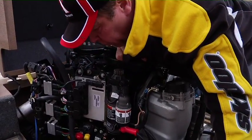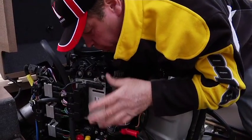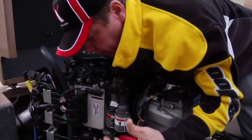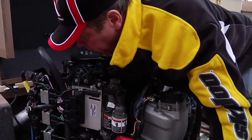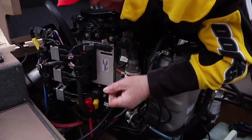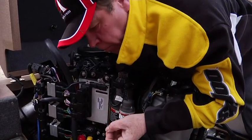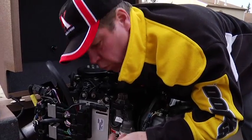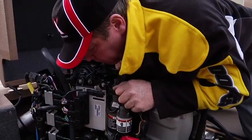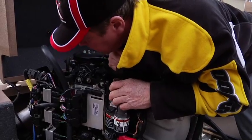There is a really nice Mercury diagnostic system we have in our service department, as most Merc dealers do. If there's an odd issue, a running issue or something, we have a diagnostics that can point us usually right to the area of concern. There are some fuses on the engine for the fuel pump, the starter system, and so forth, and I recommend you carry just some extra, I think 5, 15, and 20 amp fuses, just one of each, just to carry them in your toolkit. They're the common double spade automotive style fuses.